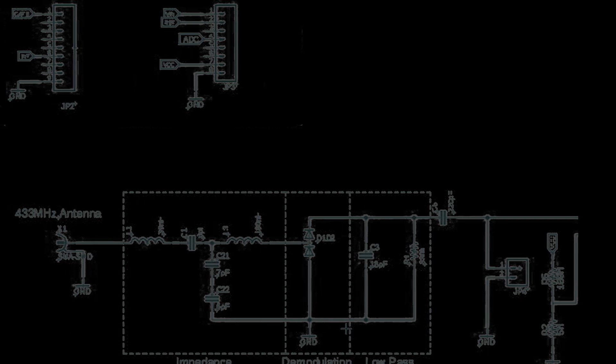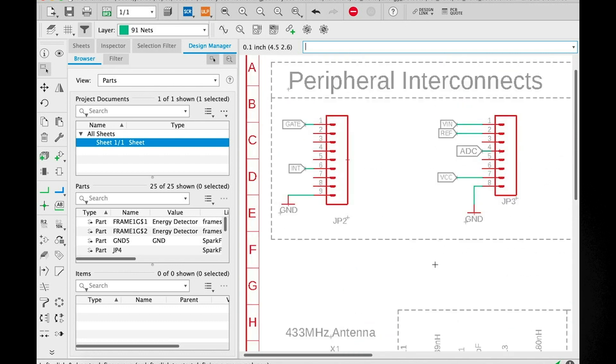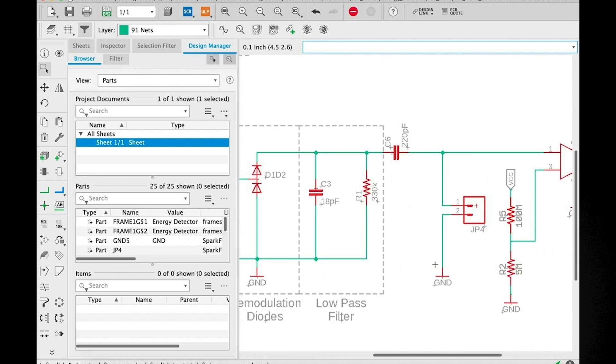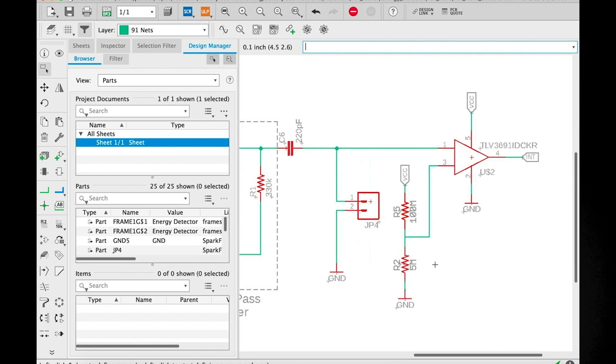Today I want to stay high level and talk about the process, and you can let me know if there are pieces you want me to dive deeper into in a future video. The first thing we're going to design is our schematic — this is the logical layout for your circuit. It has the components your board is going to have on it and the connections between components. At this stage you don't really have to think about where things are going to go on your board or how big it's going to be. This is just where we draw out our circuit, look at how the electricity is going to flow, and how things are going to be connected.